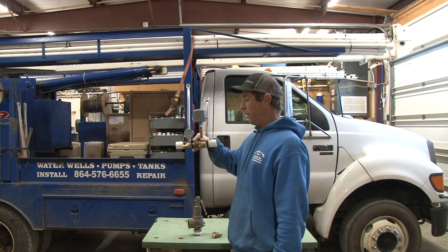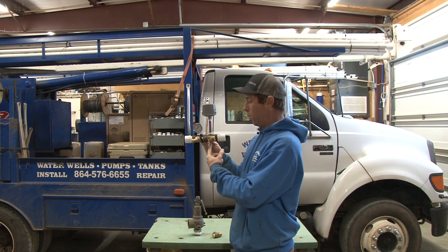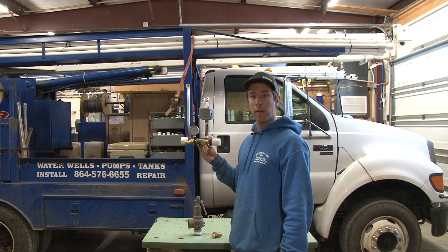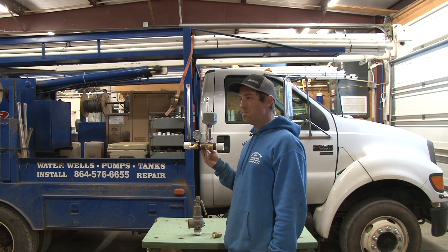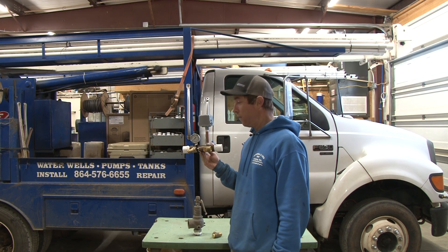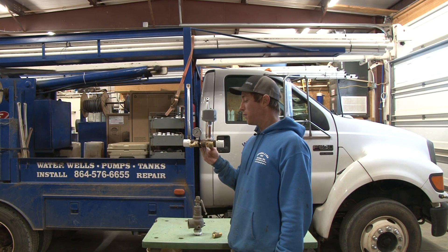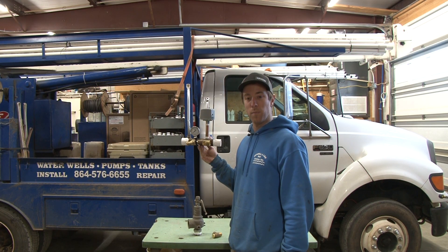It's going to bleed off water. It's as easy as putting them right there at your pressure tank. This tank T screws into your pressure tank — you just get one with another port with a relief valve on it. You can come in here and screw this cap off and set it to whatever pressure you need, and it's going to cost you probably every bit of about $10 to have that. Is it probably necessary? Yeah, anybody can argue that it's not going to be necessary. Is it always better to be safe than sorry? Yes. Why not just have an extra relief valve on there to prevent your tank from overpressurizing or prevent your pipes from bursting?